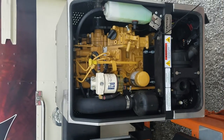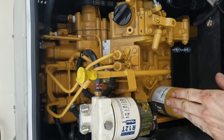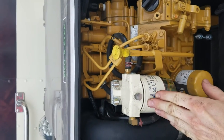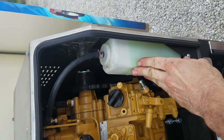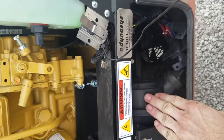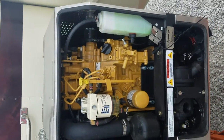We're here at the Dynasys SL APU — it's a Caterpillar motor. Right down here we've got your oil filter, fuel water separator, your coolant overflow, your air filters, and your oil drain at the bottom. Very easy unit to work on and maintain.